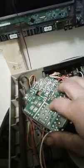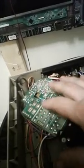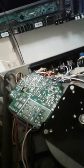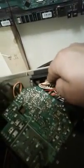There was also a lot of old glue that had started to run, puddle, and carbonize. I didn't like the looks of it, so I carefully chipped it off between the traces and all the solder points to make sure there was no bridging between any contacts that wasn't supposed to be there. That did help the performance of the record player, but it was really the WD-40 on those two potentiometers that made the difference.